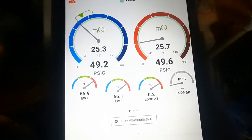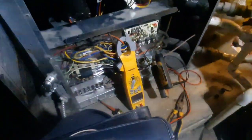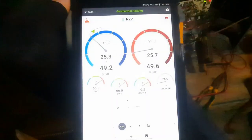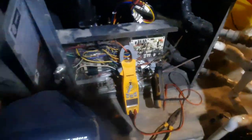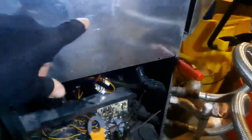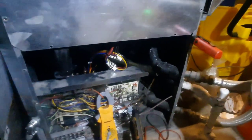My entering water — we're running about 66 degrees on both. We'll just let it time out from the thermostat and the board. I've got my meter hooked up. I've never done the geothermal test on here. Usually I just hook my gauges up like normal and see what my superheat and subcooling are doing. As long as you know your temperatures — whether it's water coming in or air coming in — you should be able to get at least a rule-of-thumb close to your evaporator temperature or condenser temperature.